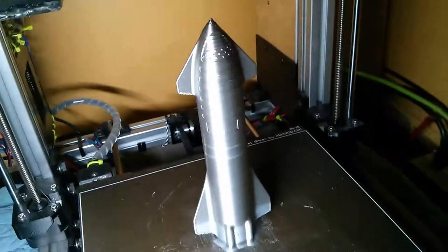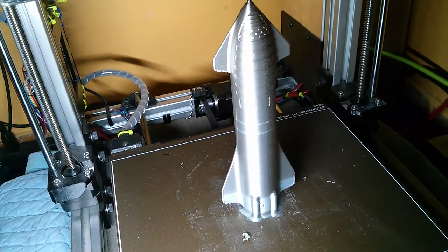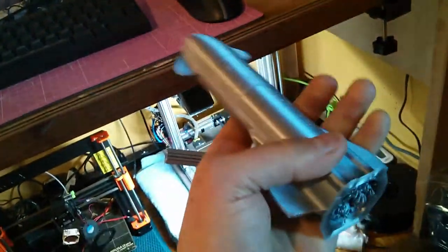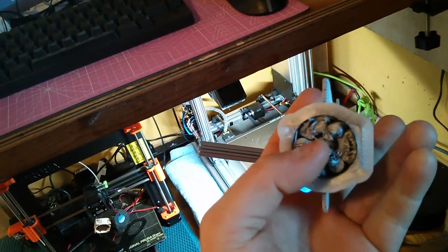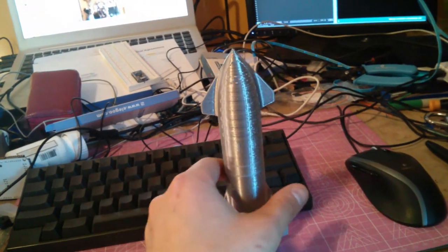It's working — so awesome! Thank you to the Silicon Valley 3D printing meetup for their help. I've printed at a lower temperature of 205°C and with no infill, and I was able to actually print this model. It doesn't feel like it's about to break apart. I forgot to do support material under there, but that overhang is pretty substantial and it still printed just fine — same here. That's pretty awesome.